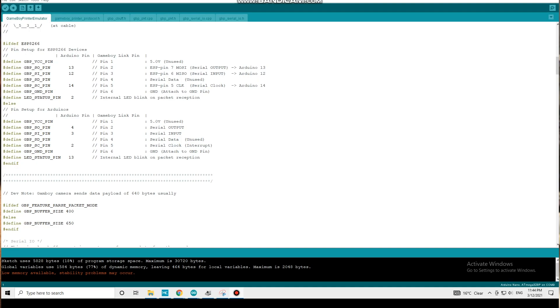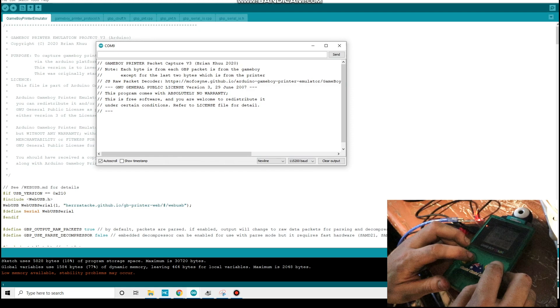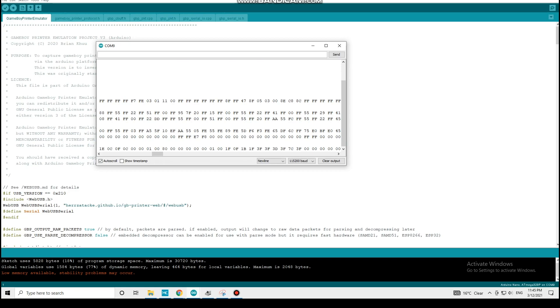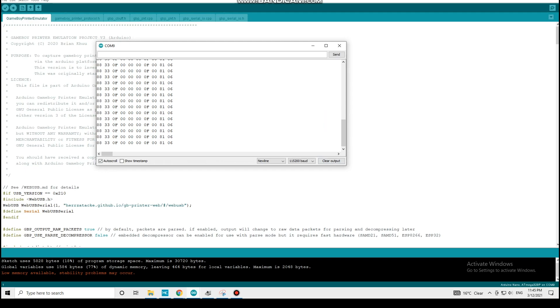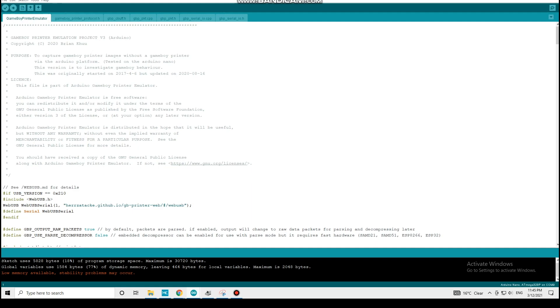So we're borrowing their code. Basically, once we upload this to the Arduino, we can go up and open the serial monitor. This is what the Arduino is currently reading. And if we go to the Game Boy, we can open our photo that we want — we want the city. And then if we press it to print, the Game Boy now thinks it's printing. You can see on our screen we're actually intercepting the information coming from the Game Boy, and we're saving it in the serial monitor here. Let it finish printing — and now it's done. All we're going to need to do is select the numbers, which is just a big string of numbers telling it where to put each pixel.